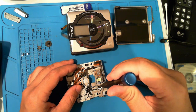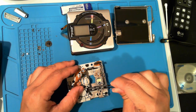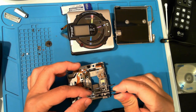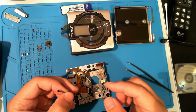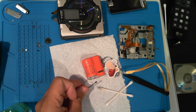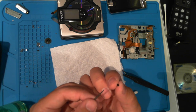Let's loosen the clamp holding the sled to that guide rod. Great. Now we're able to remove the gear shaft and examine that worm gear. Unless it's really bad, it's hard to tell with the naked eye or a kiddie microscope. But a gentle twist confirms it's cracked. It should not slip off the rod like that.